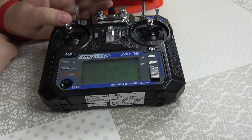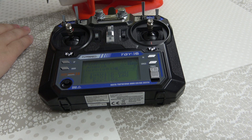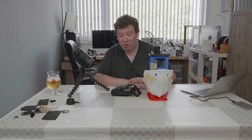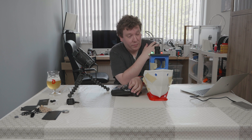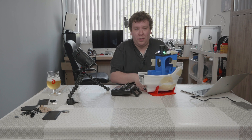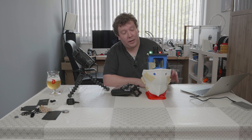If we look at the controller, there are a few buttons at the top. I have set up a small PCB, which I'll show a bit later, within the boat itself that handles everything together with an Arduino Micro. It reads the signal from the receiver within the boat, and depending on what signal comes in, it controls the lights with a simple transistor. If I switch this button, the navigation lights at the top go on — they are now red and green. At the back, if I turn it off, they go off. So those three lights are controlled with just one switch.